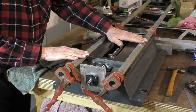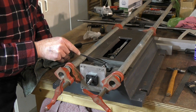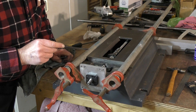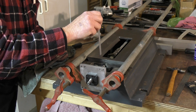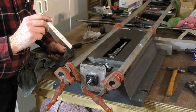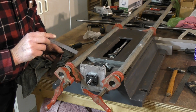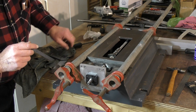If you're a woodworker, your woodworking tools will come in handy for this build. What I've done is drilled this out to 22 millimeters — that's the biggest drill I had. Cast iron cuts like butter, no problem at all. I've taken the center of this screw further down from the original by four millimeters, and I've also ground out the hole in the back — actually a half hole — to allow it to drop down that amount as well.